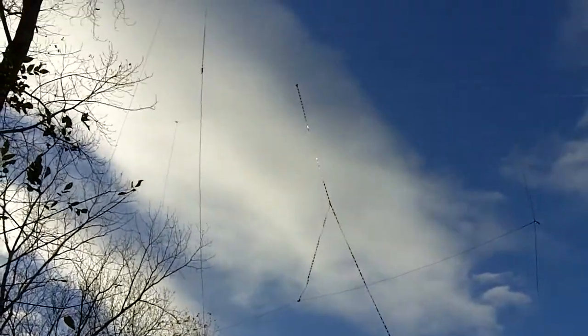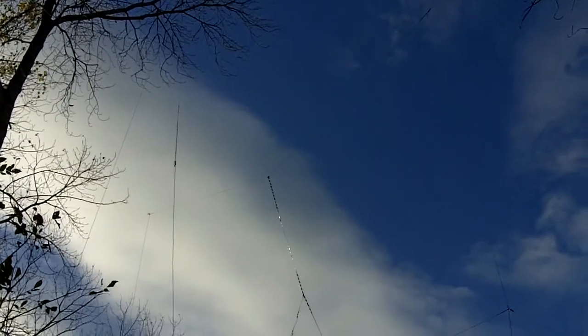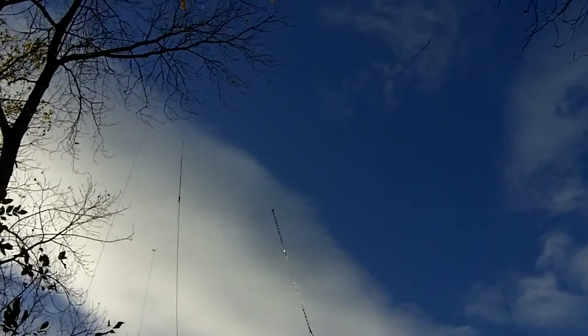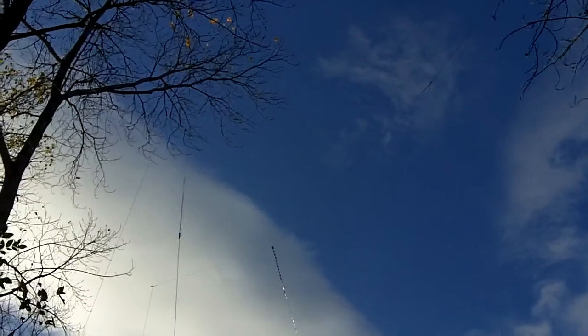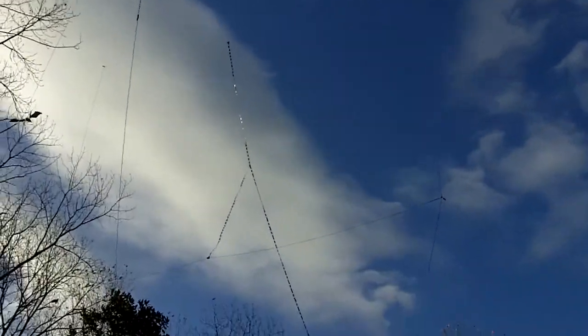In the background you can see an antenna going straight up to that tree limb. That's a wire J-pole made out of 450 ohm ladder line, a 1-to-1 voltage balun, and 14-gauge stranded insulated wire. That's not part of the Lazy-H, but I'll do another video on that later.